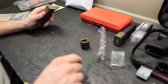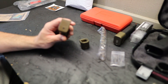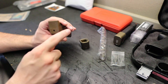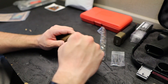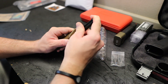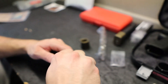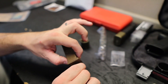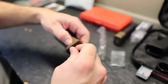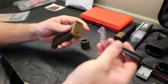You can see this detent on the top of the magazine on the floor plate — the factory floor plate says Glock. You insert your glock tool here to depress it, then pinch the sides to overcome the two locking tabs on each side of the magazine. Once you do that you've defeated the floor plate.